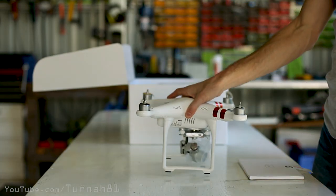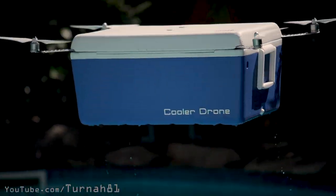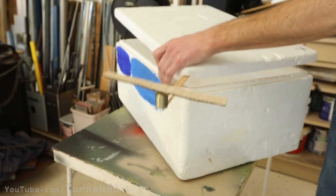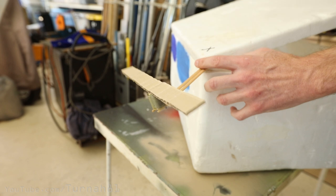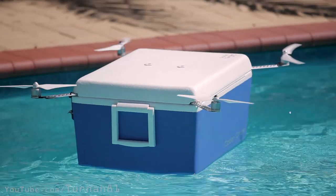After getting the Phantom 3, the first step was the actual box design. I knew from the start that I wanted it to land on water, so it would have to be quite wide at the bottom so it wouldn't capsize. Because it would be landing on water, the propellers couldn't be near the bottom — they'd just be in the water. From a balance and aerodynamic point of view, around the middle would be best, but I came up with the idea of having everything nicely around the lid — away from the water, all components integrated into that thin lid section, which I could hopefully open as one big piece. You don't want to open the cooler and have a lithium polymer battery in there with your beers. Also wanting it to land on water meant no camera view at the bottom, which just made me sad.